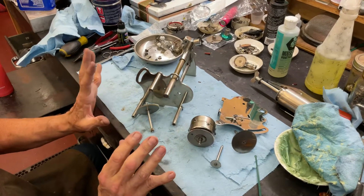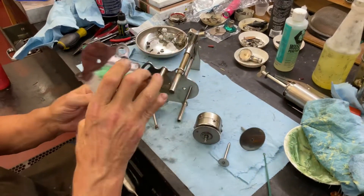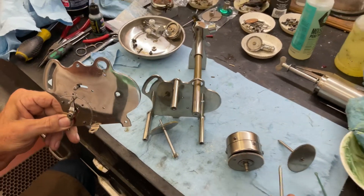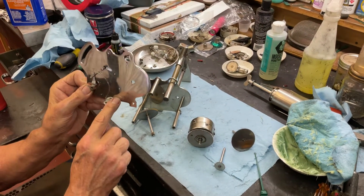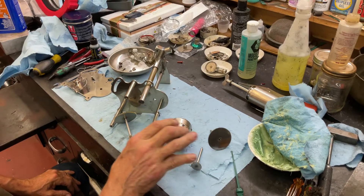So how are we going to assemble it? We don't want to use oil, because once we put everything in these holes for the pinions on the gear trains — that little piece right there — we don't want to see little dribbly oil running down the side of the beautiful nickel. So what we do is we use the illustrious green grease.